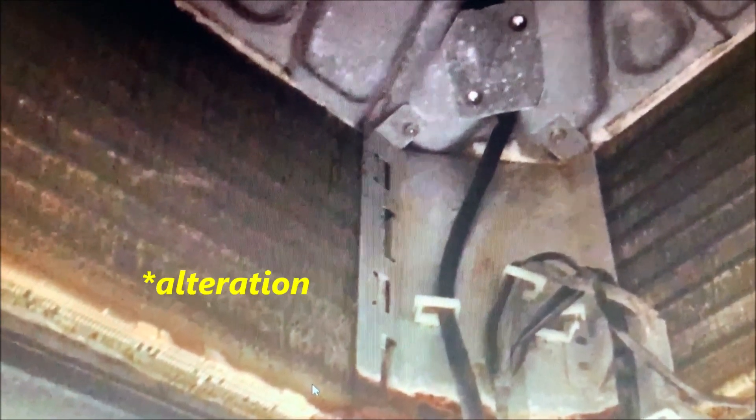I'm always for non-invasive repair, no altercation whatsoever — no need to alter anything in order to work on it. This little piece right here has two screws, and once you take those out, it's going to drop, because this holds both sides of the coil together. You'll notice where it slides in there — this kind of slides in on the other side and catches. When you take those two screws out and remove it, this whole coil will drop down about two or three inches. No big deal. Your EEV nut's right there. You can get two wrenches on it, back it up, take it off, and change out the head.